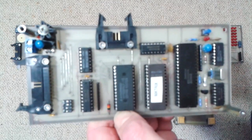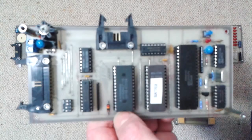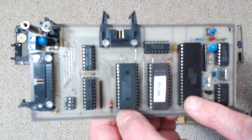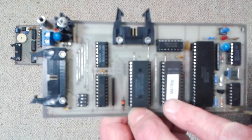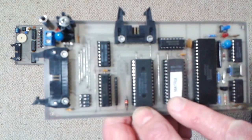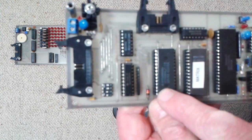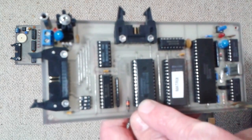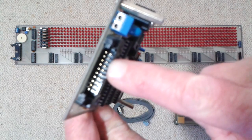This project was made long before the advent of microcontrollers. The chips at the time were the famous Z80A CPU running at 4MHz, a 32K EEPROM which stored the program and the library messages, and a 64K static RAM which stored all the messages that you would key in. There was a 20-way ribbon cable which connected to the main display.